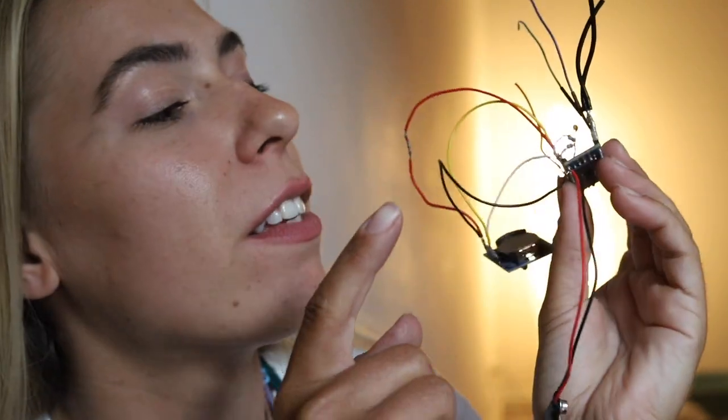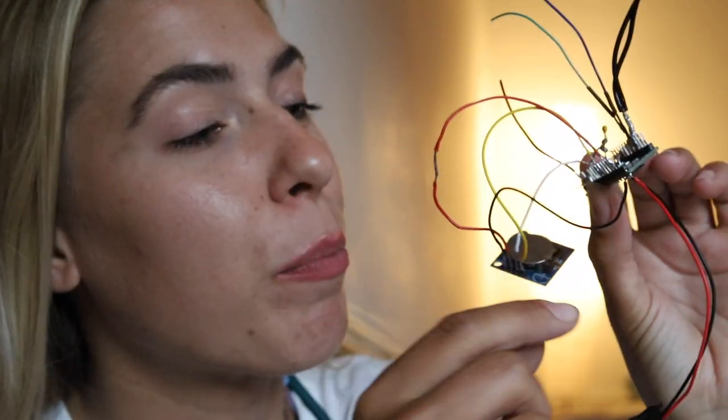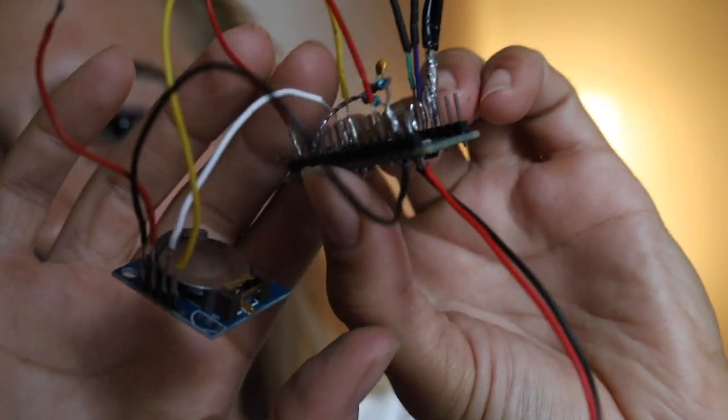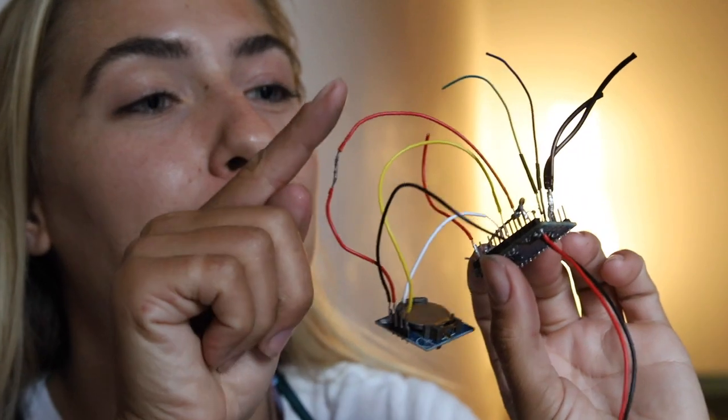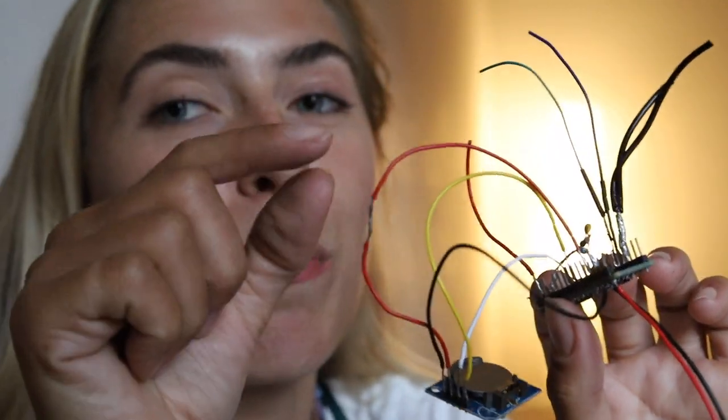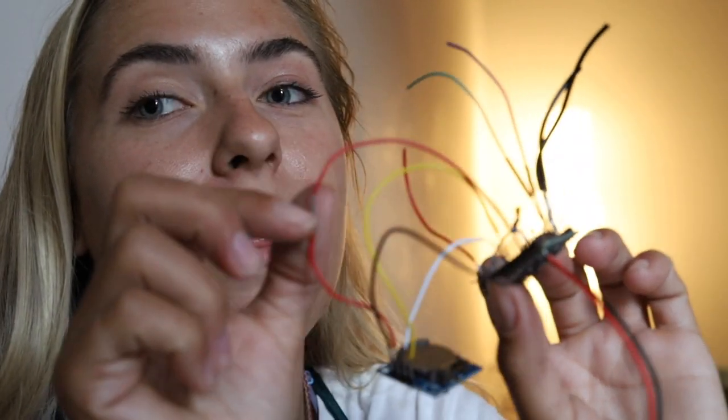Now, before you say anything, these individual joints will not short. They are not protected with shrink tubing. So why will they not short? Because I will protect them tomorrow. How will I get the shrink tubing onto the solder joints if they're already connected? Well, I will cut these wires, put the tubing on, shrink it, and then put another piece of tubing here, and then solder the wires together, and then cover them again with shrink tubing.